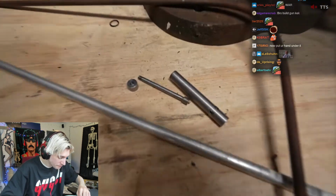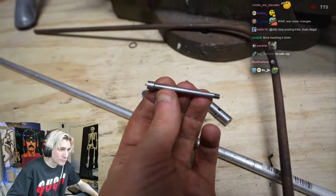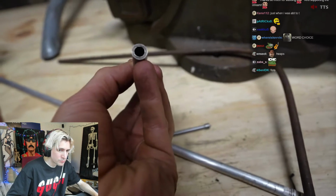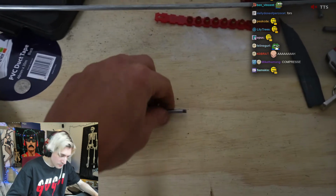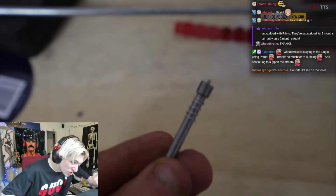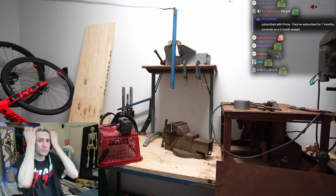Which sounds like a good thing, but when it's on the end of the pool stick, this means it will shoot off the end or just blow up. It also means I'm wasting heaps of gas, which could be pushing down the piston with more force. So I drilled some more exhaust holes in the barrel, and also put in this tiny spring to hopefully help the piston survive the extra force. 3, 2, 1.